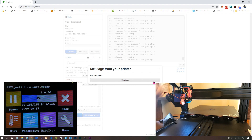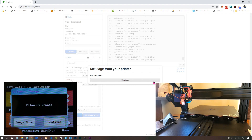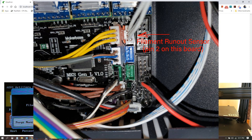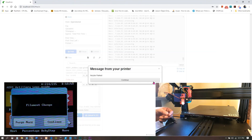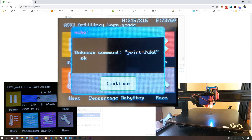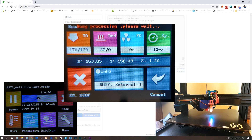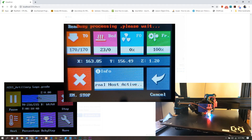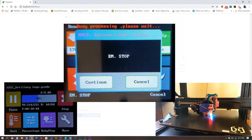If multiple serial inputs become possible, I was thinking about moving the TFT to one of the other ports on the board, which would hopefully separate the two signals and allow easier implementation of Marlin mode signals. If that works, there will be no need to move the filament runout sensor to the main board, which is the only hardware modification required to use these M600 features. If you leave the filament runout sensor on the TFT and filament runs out during an Octoprint session, the TFT would have to force an interrupt of incoming signals from Octoprint, which could cause garbled G-code commands. There is also an emergency stop button that allows you to immediately bypass the queue and send an M112 command through the emergency parser to halt the printer.